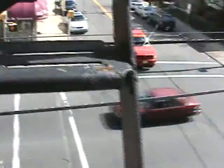This fire escape has been through bolted. You can see the through bolt there, but it's exposed. You can see the shaft of the bolt still exposed to the weather. So those connections are suspect due to that.